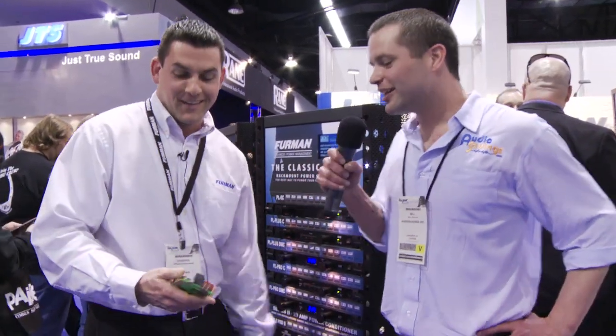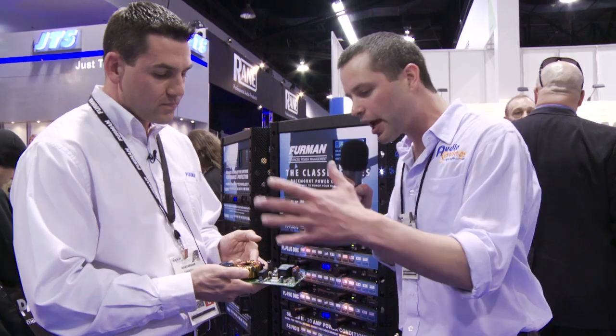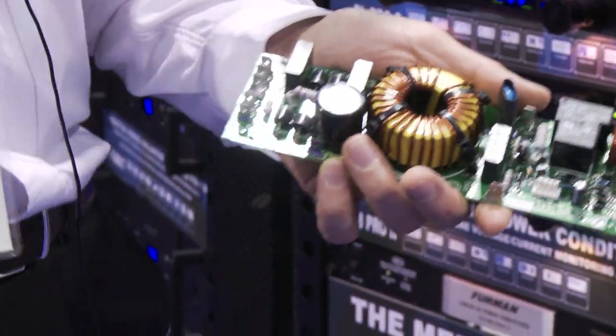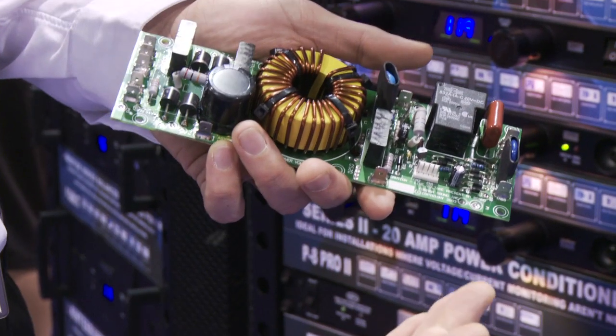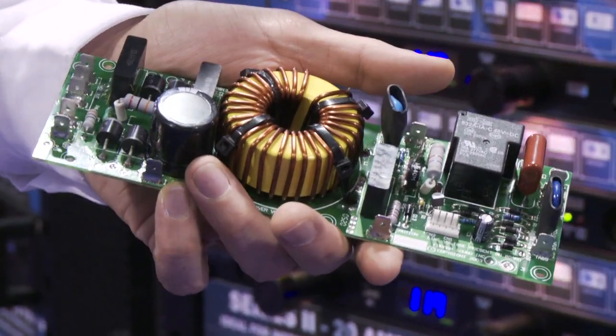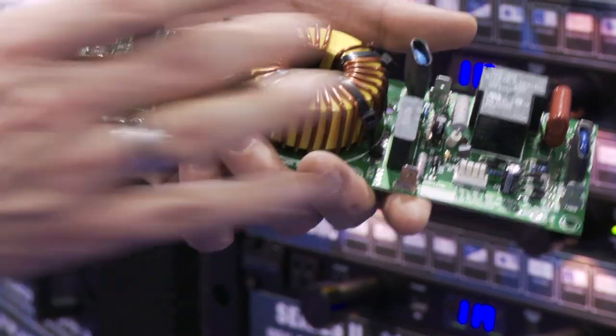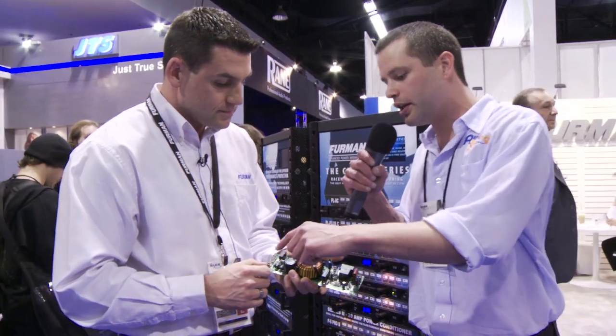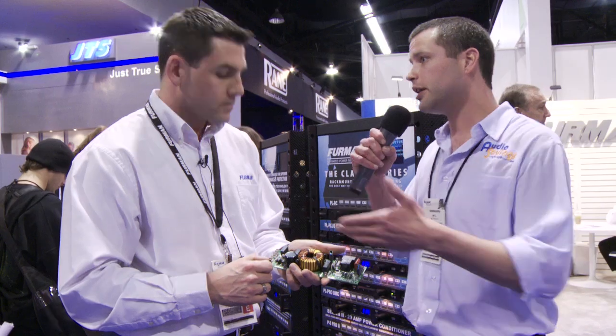At that point you're probably running out of a burning building. So what do we have — capacitors? The most significant component is the inductor, this donut-looking thing. It acts like a shock absorber in your car: the fast surge comes in, it slows it down. We take the opposing surge, charge up this large capacitor, then convert it from alternating current to direct current — AC to DC — before it actually hits the MOVs. So the MOVs get to do their job, this acts as a bumper, and the capacitor allows for that steady flow of electricity: clean power.